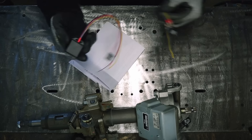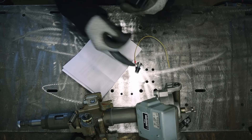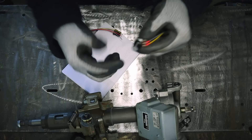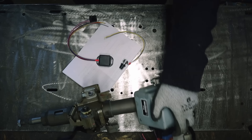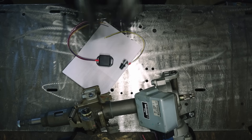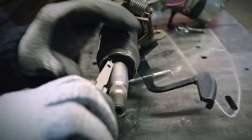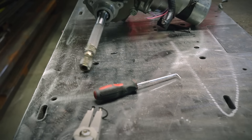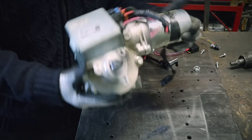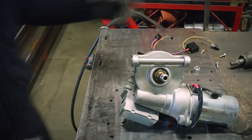It's actually kind of a brain box and a potentiometer — that's it. This is needed to turn on the steering module, and the pot is simply to set how strong we want the power steering to help us steer. Now that thing is way smaller — I prefer this version. So this is in, this is out. Let's write it down.